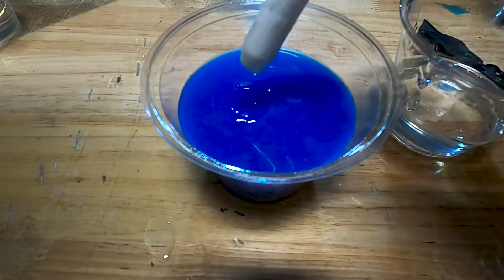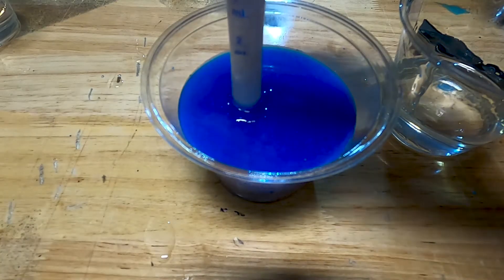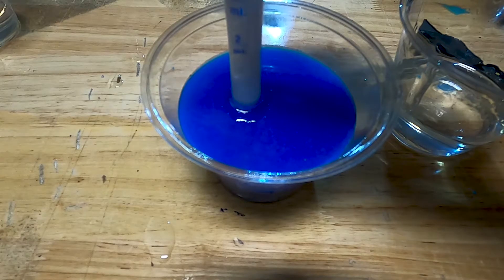As you can see in this clip, I'm using enough resin so that it comes out of the other vent hole. This is telling me that resin has gone throughout the entire mold and is completely filled up.